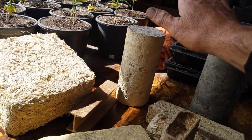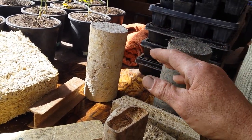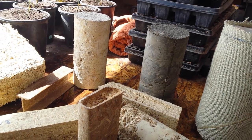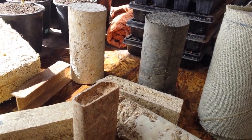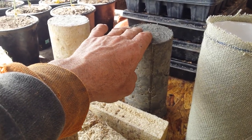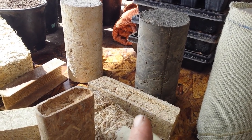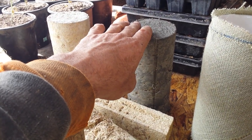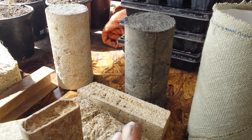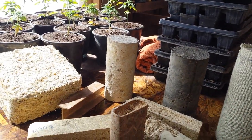No matter whether it's lime with bentonite or a thin-set — it's called stabilized, that's all it is. Stabilized portland or stabilized lime. Thin set has something in it — whether acrylic, latex, or bentonite — to make it sticky and pliable so it can be struck, where plain material can't. Regular portland on a three-by-six ingot can only lift up to 2,000 pounds — it'll shatter before 2,000 pounds. This one with hemp in it is considerably stronger, and wrapped with a girdle it's exponentially stronger yet.